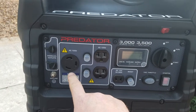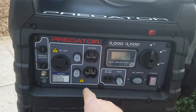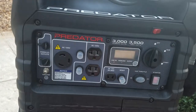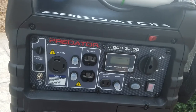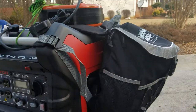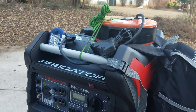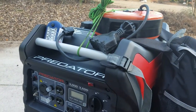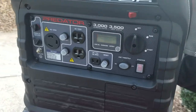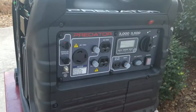I also turned the outlet 180 degrees so I can use my RV plug. That will be coming out at a 4 or 5 o'clock position instead of the dreaded 9 or 10 o'clock position that actually unlocks itself. I also did a video about my bag and the reel of cord I use — I pull it out to the equipment versus bringing the equipment and cord out to the generator. That saves a lot of time, and letting it reel itself back in makes things a lot neater.